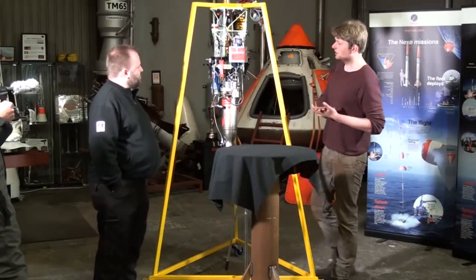There are quite some issues with a system like this, especially in the field of control engineering. I tried a little bit to address that, but it was too big a scope to fully implement. It's essentially a big stick-slip system — you have check valves which are spring-loaded, so the pumps have to build up pressure to compensate for the spring load, and it's not as easy to control as electric actuators. But it's still quite an amazing feat, because this came from a design description and a list of requirements and ended up as this beautiful piece of engineering.